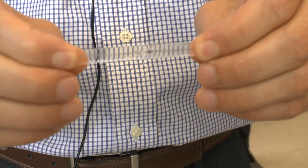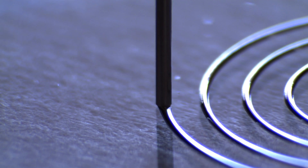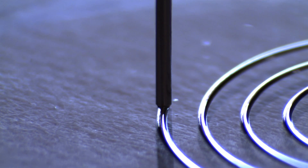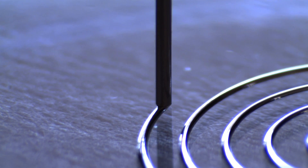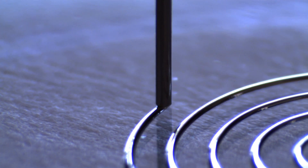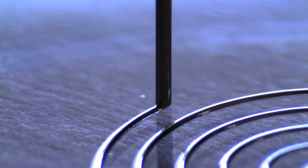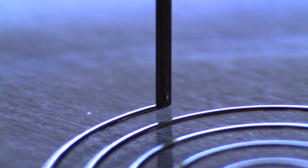In the case of our printing work, the metal comes out of the syringe and immediately reacts with air to form this oxide skin. As we move the syringe along the surface, the oxide sticks to the substrate and also stabilizes the structures mechanically. So we can print them into lines or spirals, and they hold their shape because they're essentially stuck inside of a little bag — and the bag, in this case, is the oxide skin.